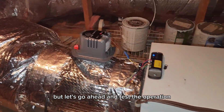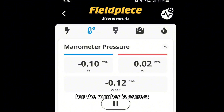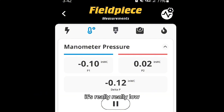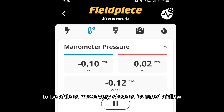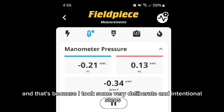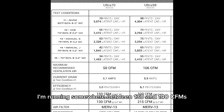As we're almost wrapped up, I've got my smart probes on there. Let's go ahead and test the operation. With the air handler off, the dehumidifier is only seeing 0.12 inches of static pressure — that's really low. It's going to allow the dehumidifier to move very close to its rated airflow. Even with the air handler running, static pressure is a little higher but still not bad — because I took very deliberate and intentional steps, tying my supply into the supply duct and choosing a low return pressure location to keep static pressure low even when the air handler is running.